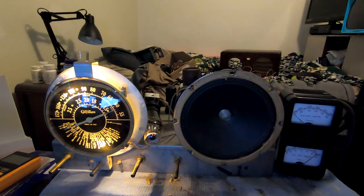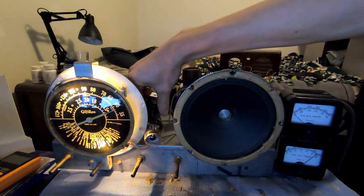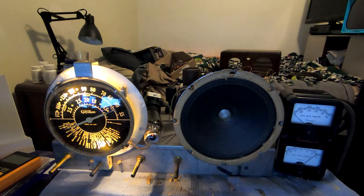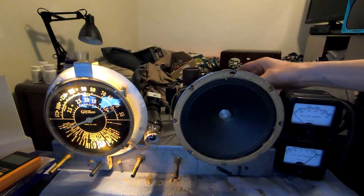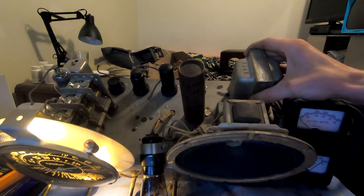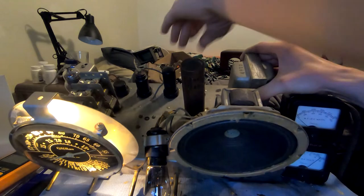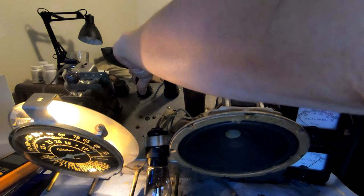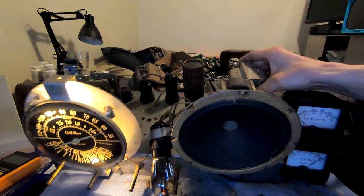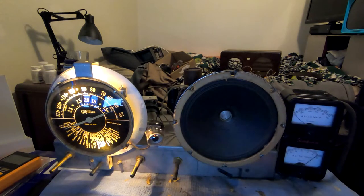You can probably tell from here that the bottom and top corners have illumination but the spots in the middle are a little dim, so I'll definitely be reactivating those other lights to get it more evenly lit — it should look pretty good when it is. The eye tube filament is good, although I have plenty that have good filaments but are duds otherwise. The transformer is not getting hot, which is good. The 6K7 is warming up — most of these being metal tubes, there's no real way to tell unless they actually get warm. The next step is just to pop the rectifier back in and see how it does.